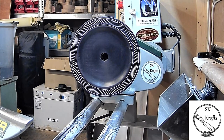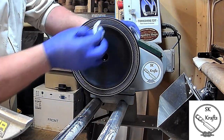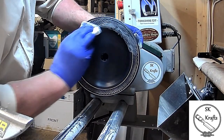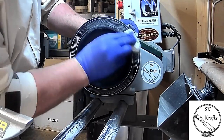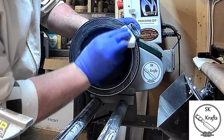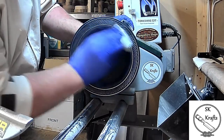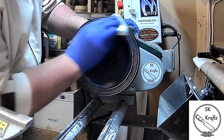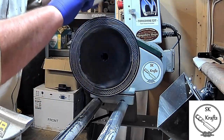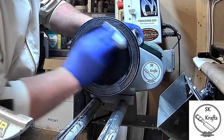Now what I'm going to do is use the silver embellishing wax and fill all this in and give the whole piece a coat, to hopefully give us the finish like we've got on the piece we did Thursday. I'm going to rub this into the wood to fill the bits I've just cut out — if we've got enough embellishing wax. You need to really work that into the grooves because if you don't that won't look right. That's just enhanced the texture and the band around the outside, and hopefully that's going to match the other bit we did the other day.